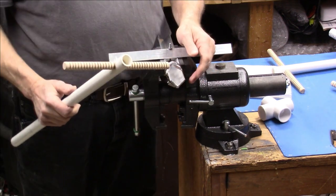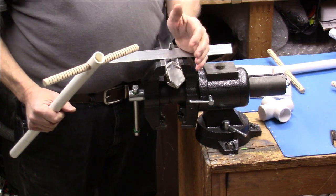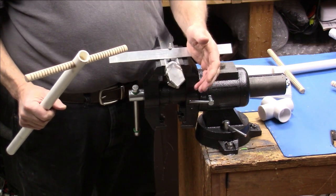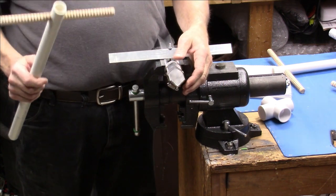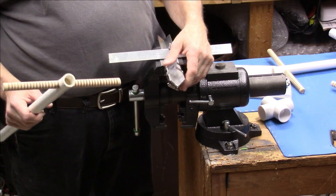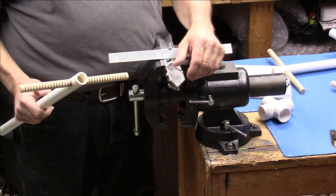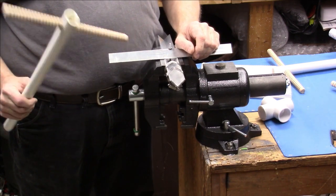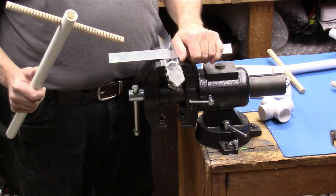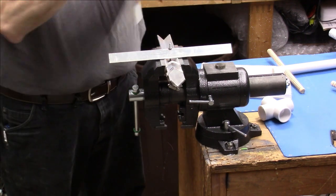And by building one of these, you get a feel for how many turns, how long the wire is going to need to be. This one's going to take about 300 feet of wire. I'm using number 22. You could use number 24. You could use 18. Just remember, the higher the wire size you go, the more stress it's going to put on a lot of these components. So let me build this whole thing, and I'll be back in another shot here. Stand by.